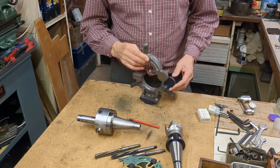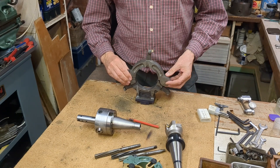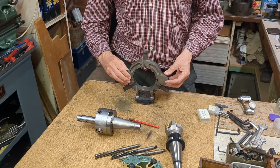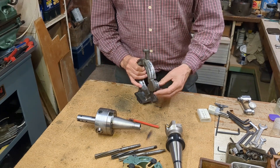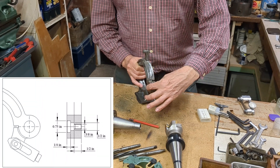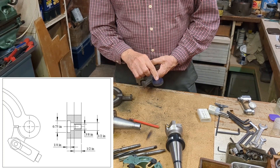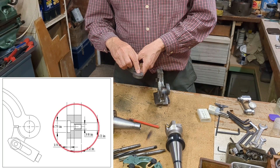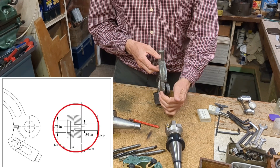Today we're going to be working on this hinge, and it's quite important because I want to ensure repeatability — after opening and closing again I want to be able to maintain the setting. To do that we need a nice close-fitting bolt which provides good radial location and also stops these from separating. The design calls for a threaded hole here and a nice close-fitting hole on the bolt with a counter bore and a large head on the bolt to clamp everything together.